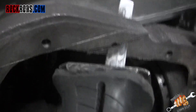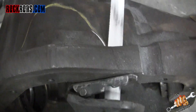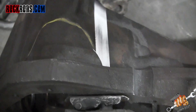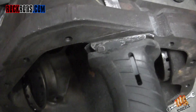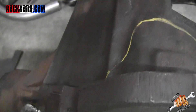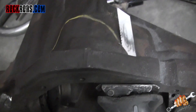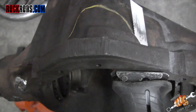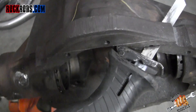The top line is where I scribed earlier, then I took my bottom plate and used that as a guide to mark the bottom line — that's actually where we're going to make the cut. I've already started to cut and it works really well just using a reciprocating cutter. Hold it nice and flat to the housing and keep on cutting — you can hit that line all the way around and all the way out the other side. Once you get that done, bolt the bottom plate to the cover and then grind it into where it sits perfectly and all the bolt holes line up.